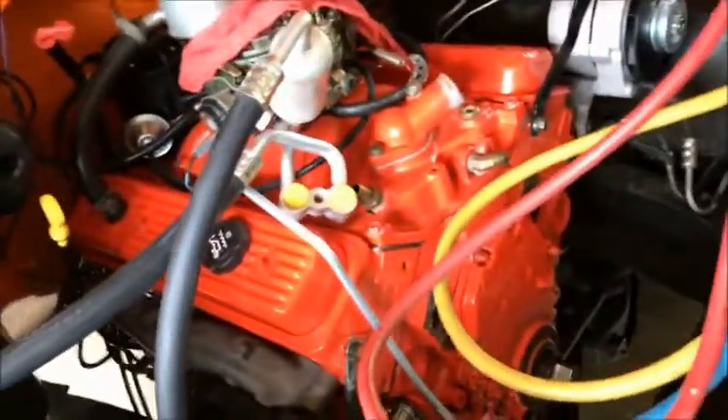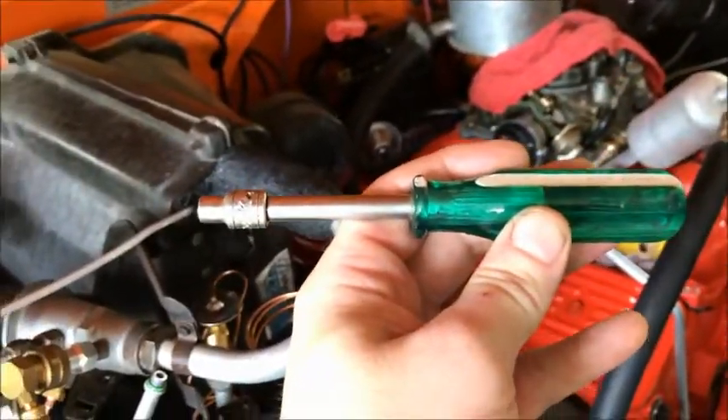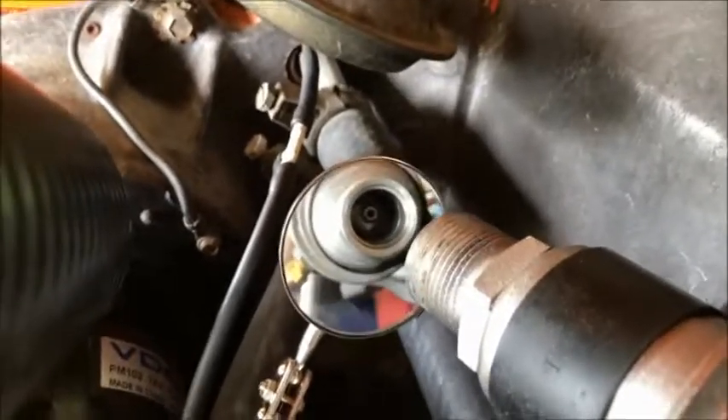The way you do that — first you've got to take off this return line to your compressor, and then you use one of these to turn a little screw that's in there. There's a nut — this is 7/32 — and where is that nut? That nut is right back there. You see it back in there? It's a little hex, 7/32.